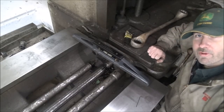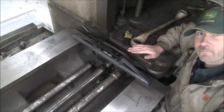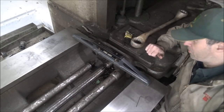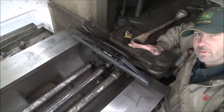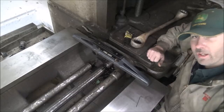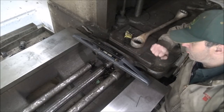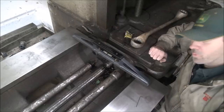Thanks to Robin Renzetti, I found a company that makes this vial, or made this vial - it looks just like it. So I'm going to have to try and get a hold of one of those and see if I can get this thing fixed. Because right now it's non-repeatable - it's bad enough that it was inaccurate, but since it won't repeat, it's pretty much totally useless because you don't know which way to go. So let me show you what I've got going on here. If anybody runs into this in the future with a level, perhaps you can at least be suspicious and not waste a bunch of time - you can verify this and do this check and see if your level is a piece of junk.